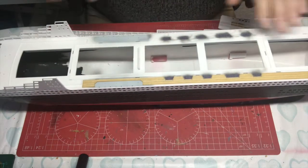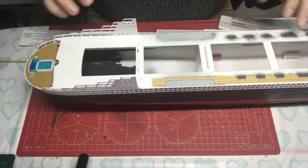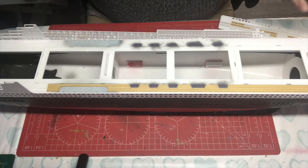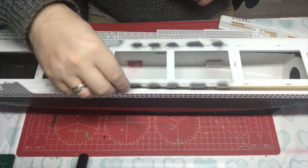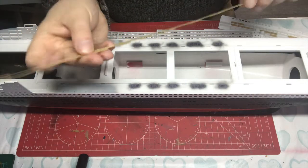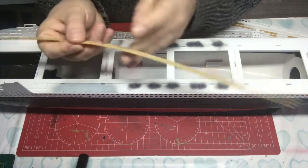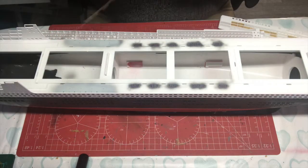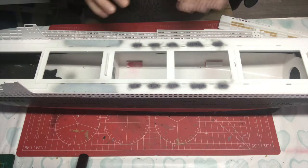We have further deck that goes in this section here and then deck that goes on the end here. So what I'm going to do is lift the camera up so that you've got a better view, which means you'll be a bit further away, but you'll be able to see what's going on, hopefully. My plan of attack is to put this piece of deck in first, and what we'll do is we'll peel back to about there and slide that into place and then slowly peel the rest of it back and put it down. But before we can do any of that, we need to give this surface area a good clean of any dust and debris.